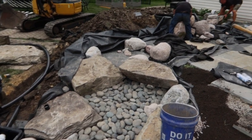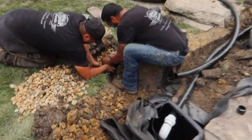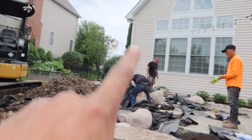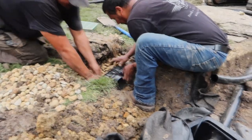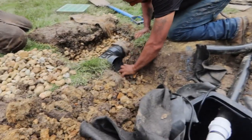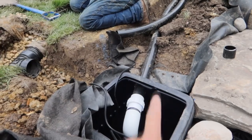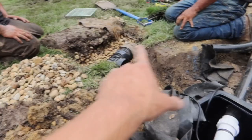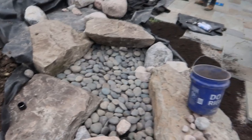Things are starting to take shape. We got our pipe going in right now — the guys are putting in an overflow. They had an existing line coming down from the downspouts over there that came all the way around, and there was a box right here with the intent of connecting this feature into that for an overflow. The guys are just throwing that T in, and then we're going to throw a piece of ADS pipe to the top of this basin. When this basin gets too high, it's going to overflow into that pipe and go down into the drainage system. We got the basin 100% done.